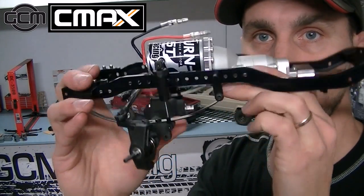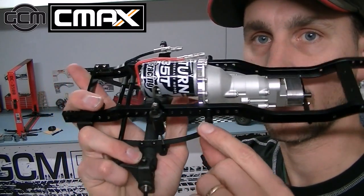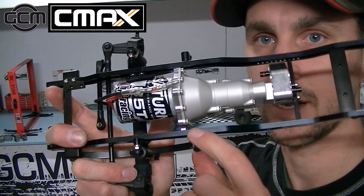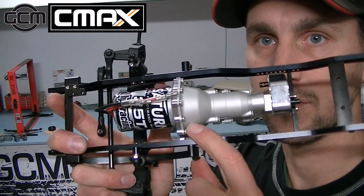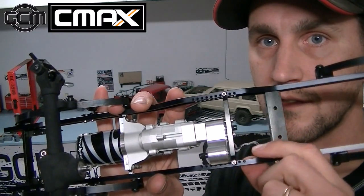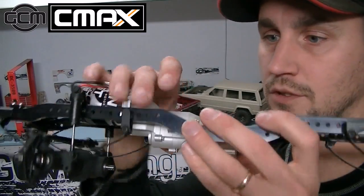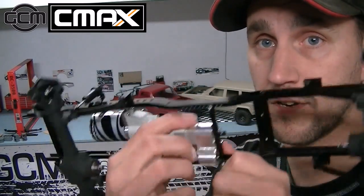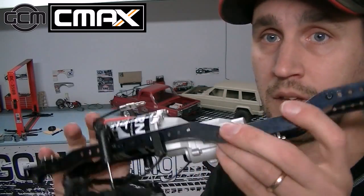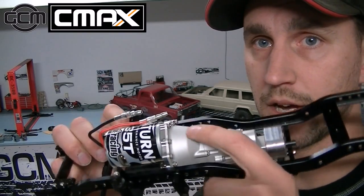And the way that you set up the swing hanger is you'll see in your swing hanger kit that the front swing hanger is actually attached from the inside of the frame rail. So you would want to do that with your drivetrain out. That's very simple. You can just take out these 2 screws, slide the drivetrain down and sideways, and literally the whole drivetrain will come out with the 2 cross member screws on the transfer case.